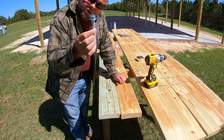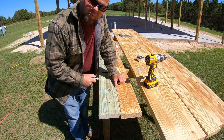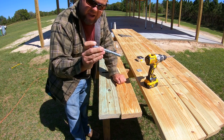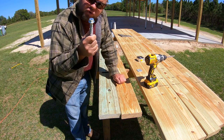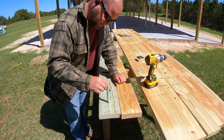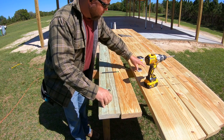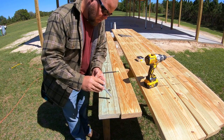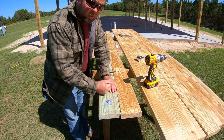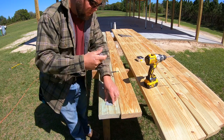These are called Titan HD anchor bolts — very highly rated, extremely strong. They undercut the concrete and hold in great. We'll use a plate washer to hold them down. This wall is not going anywhere. My plans call for double top plates on every wall in the house. These back walls we're about to build are eight-foot walls because they have to support an attic, so a double top plate definitely makes sense.